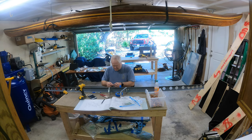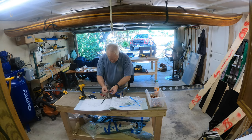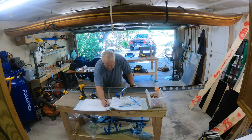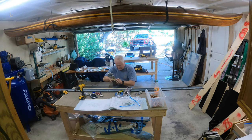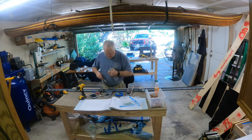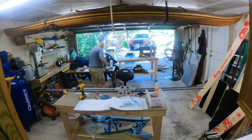Checking my plans as always. Then you go through and mark certain holes that you are not to dimple — you only skip dimpling those holes on these inner ribs. You dimple all the number 40 holes on the rest of the ribs, except for the ones on those small tabs of the HS1004 ribs. And that is a mistake I made — I actually dimpled the number 40s on the small tabs, and you'll see me raise my fist in anger in a moment.